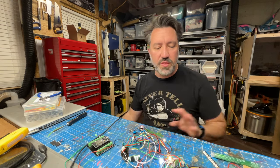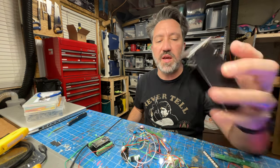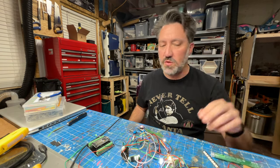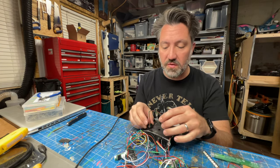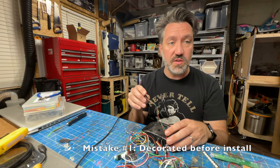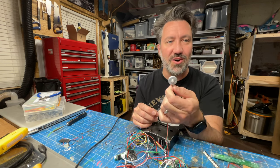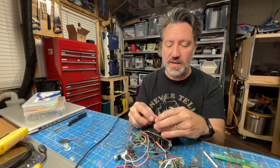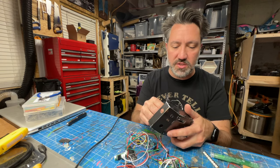I'm going to take a quick break. When I come back, we're done with soldering and we're going to get everything into the chassis. That's the next step — getting everything in here, then talking about how to connect that to the pack. I made a small mistake though: I forgot I need to feed the LEDs through the outside of the enclosure, because I already glued this piece in place and can't otherwise get them inside.